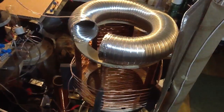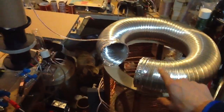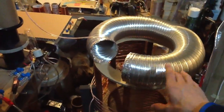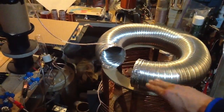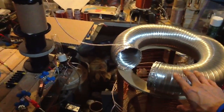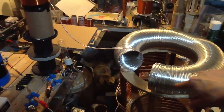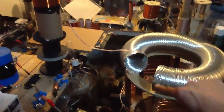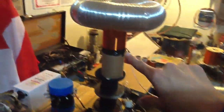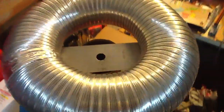So we've got a true magnifier setup with a little bit of Eric Dollard information in there. I've learned that a lot of the really big magnifier builds have even a toroid to protect against corona loss off the secondary. But it acts as a shorted turn if you have the toroid connected, so it needs to be a split ring sort of thing. That basically acts as the final turn going in the proper direction, and then that joins the true resonator quarter wave helix, which has a standard toroid on the top — a piece of aluminum there.